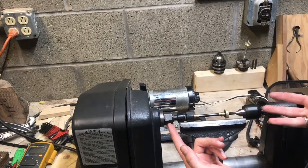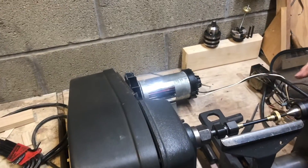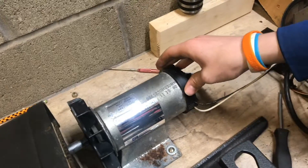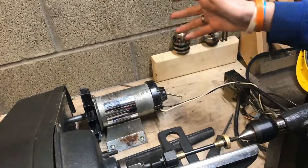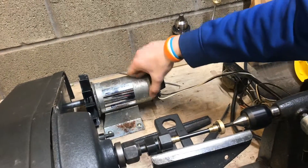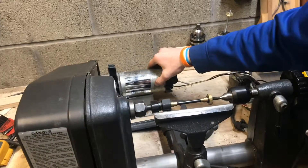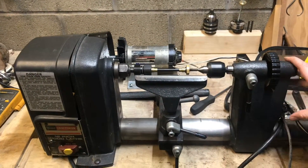Our outlets in the United States put out single phase, and that converter plus a three-phase motor would cost about a hundred and eighty dollars total. This motor came from an old treadmill — and believe it or not, it was a dollar for the whole treadmill. Just look at yard sales and thrift stores when people are throwing them out. These motors are useful for a lot of things; if you want to convert other machines in your shop to variable speed, they work really well. I hope you found this video useful — if you did, don't forget to like and subscribe, and we'll see you next time.